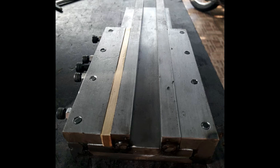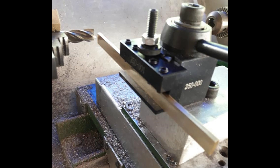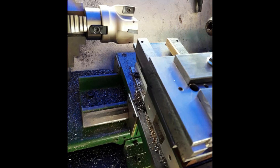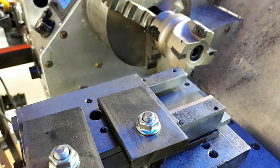That discovery enabled me to rethink the way I was going to go about building new slides, and provided me with all the materials it would take to do so. I bought lots of different bits and pieces — squares, flats, and rectangular pieces — and kept working it out. I had some height constraints considering I had to work to an existing spindle, but I kept at it and eventually ended up with all the right bits and pieces. Some sizes I couldn't get right and had to mill down or cut at the angle grinder, with lots of drilling, tapping, and bolting, but eventually I came up with something really rigid that I think will work very nicely.